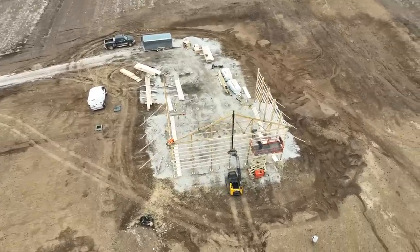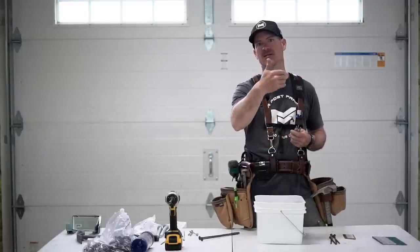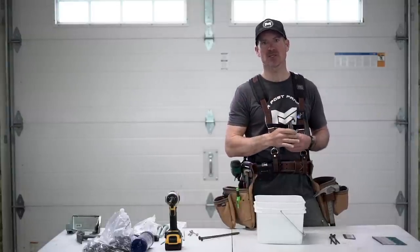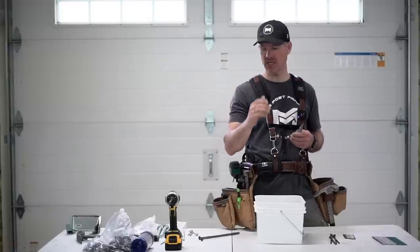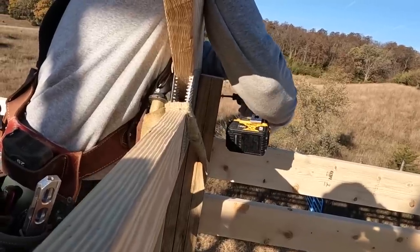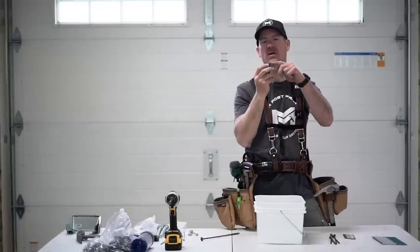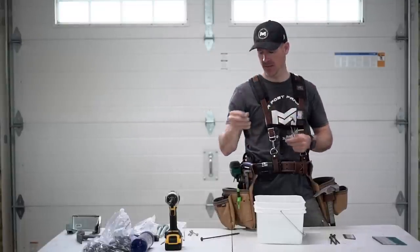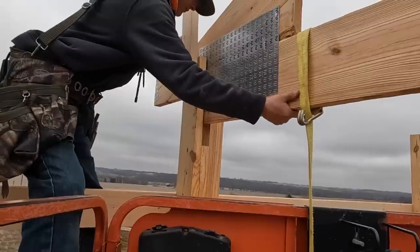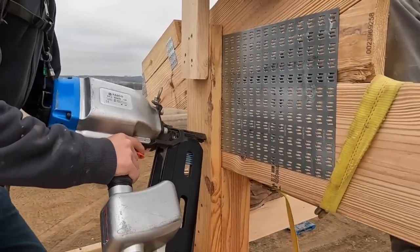That end has plenty of nails to hold the truss — you're getting a ton of nails in there. We'll typically run eight to ten into the actual end columns, and if there's a two-by-four cross member on the truss going in, we'll run two of those in and the truss is good and solid. If you need to suck the truss up to the column, we'll use a structural lag through the truss and into the column, then nail it. You can leave that lag in if it's flush with the truss. For common center trusses, we take out a ply, get them set, and run ring shank four-and-a-half-inch hot-dipped galvanized nails into both sides.